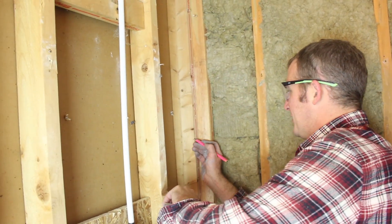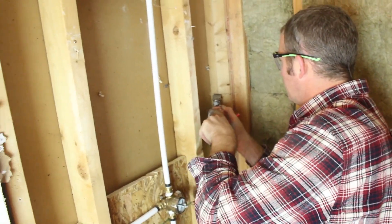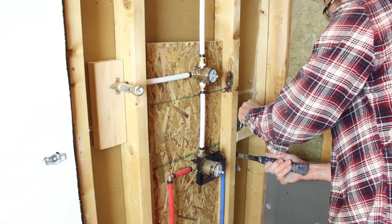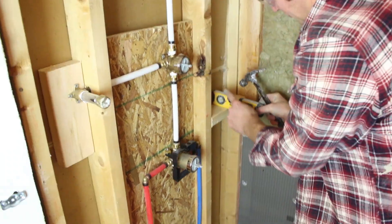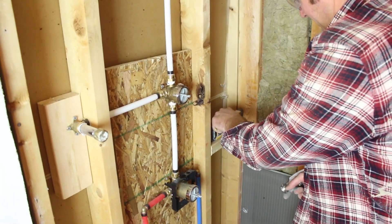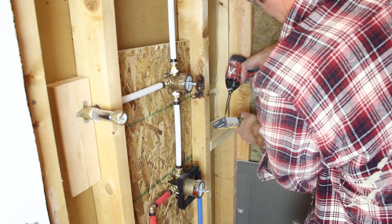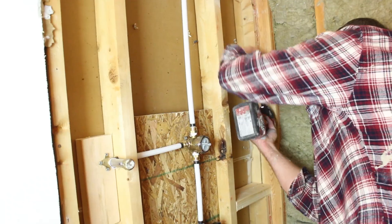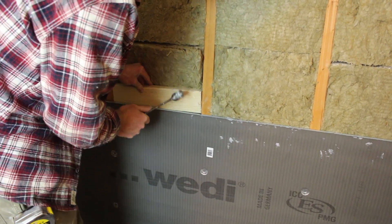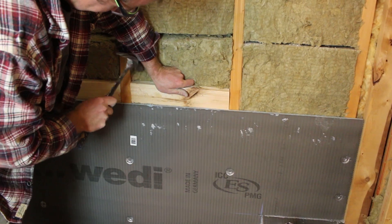So my total overall cut size will be 21 inches from bottom to top. Make sure this sits straight, and you also want to make sure it's sloping into the shower. If you have to, you can put a shim in the back to create that slope—it's nice to have the wood blocking actually sloping into the shower, which makes everything else go in more easily. We're putting in wood blocking using standard 2x4s, though you can use 2x6 or 2x8. We're using common deck screws to secure them to the studs, and the reason for the blocking is for grab bars.